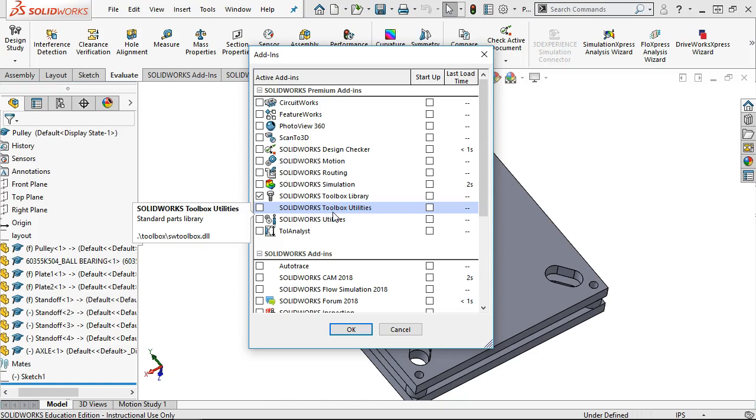The one I use the most in the toolbox utilities are the internal and external retaining clips, so when it makes that groove, and then also the O-ring grooves, it also has good starter dimensions for that geometry. And then I'll put up the website that I go to for the O-rings, because they break it down even further. Is this a pressure seal? Is it a vacuum seal? And which way you load the O-ring into the tolerance zone determines, is it pushing into the gland or pushing away from, and is it increasing and sealing the pressure, or a whole other conversation, that big thick 190-page book on O-rings and seals and gaskets that you never wanted to know that much.